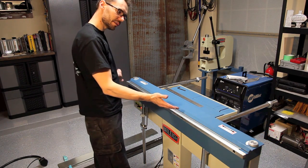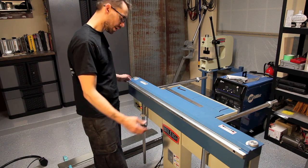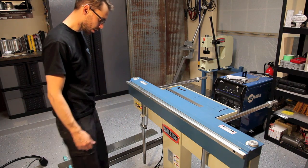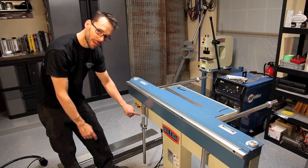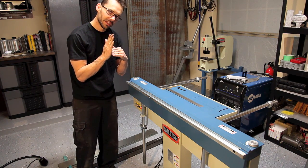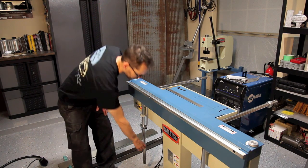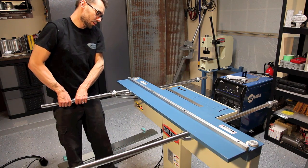So I've just laid it back under the clamping device like normal. I've got my marks lined up, I've got my adjustment dials where I want them, power's turned on, pedal's kicked down. And I reset my stop to 92 degrees, because sometimes if you just go to 90 the metal springs back, so I set it a little bit steeper so that it ends up perfectly 90 degrees. Bam.